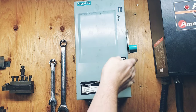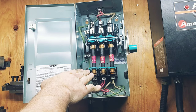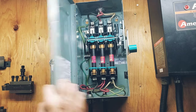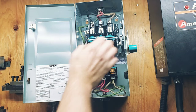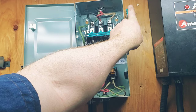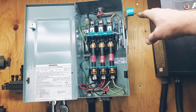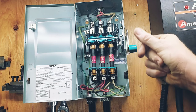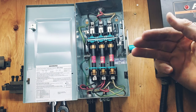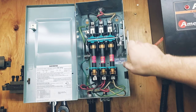This here is a safety switch that should never be bypassed — the purpose is so that when you open the door you can't throw the main breaker on, because when fuses pop during power they can throw shrapnel or sometimes throw a voltage out and electrocute you. For the purpose of this demonstration: when I throw this up it clicks and everything comes together at once, and when I throw it down it kicks off again. This is super important so you don't have arcing between the contacts — quick on, quick off.